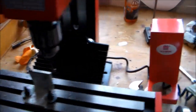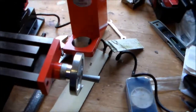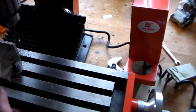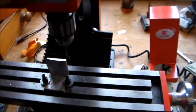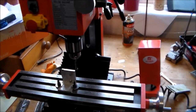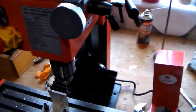On this one you do have a drainage point if you use any coolant on it. I've trammeled the table — using a magnetic gauge about six inches away from the spindle — to reduce as much out-of-alignment as I could by tapping the column, to make sure it is vertical in that plane. It seemed to be fairly vertical in the other plane as well, so that's been trammeled in approximately right.